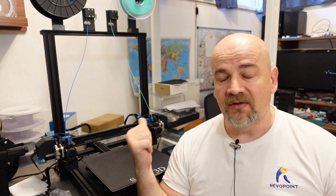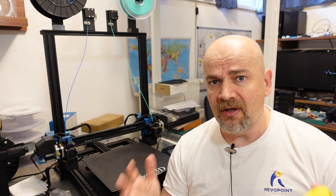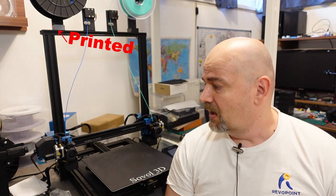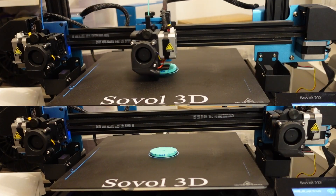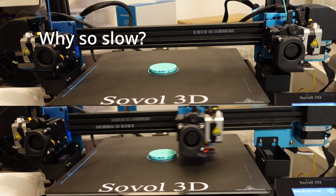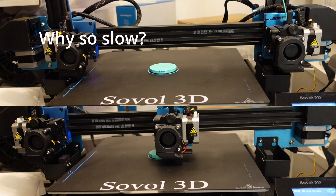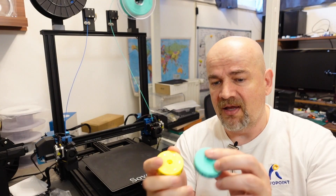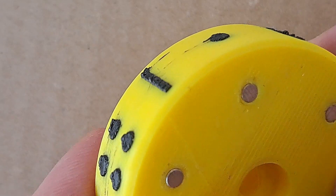I have a message to the Sovol software team. I hope they will not turn into a company that just pops out a new printer every year and forgets about existing models, because the SV04 can be a great printer but it really needs some improvements: those belt tensioners I already mentioned (I have a separate video about it), the spool holder position relative to the filament sensor, using linear rails at least on the Y-axis, and even on the software side — for example, when a nozzle is cleaned on the silicone pad before printing starts, it slows down for some reason, and during those few seconds it starts oozing, which causes some lines on the print. If you have other suggestions, leave a few lines in the comment section. Thank you for watching and happy printing!